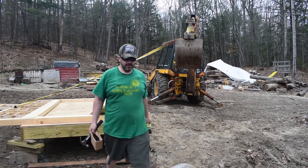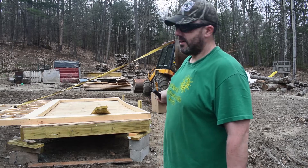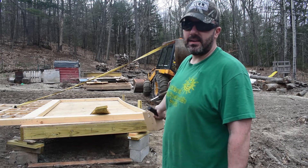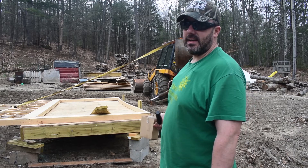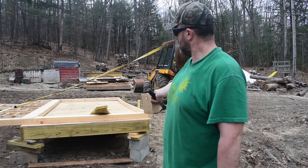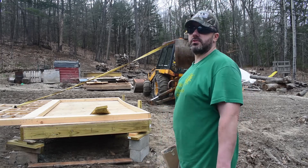The reason I'm stopping is you can see the lower board on the back wall is bending and it's going to snap. I wasn't accounting for the fact that that one board is going to end up holding the weight of the whole wall. So what I'm going to do is add more braces on the very end where the actual wall supports are, then we'll try to lift it up again.